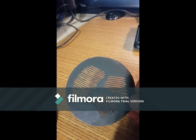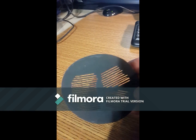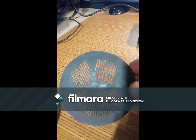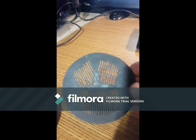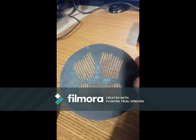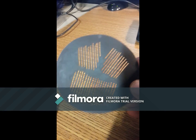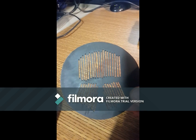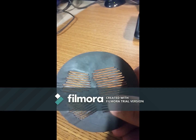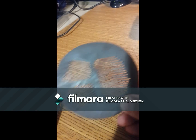Here's the final result — it's a little crude but it actually works. I took it out last night. The Dremel worked really well; I think if I'd been a little more careful, those lines would have been better. I'd worked all night the night before and only got about two hours of sleep, so I was probably too tired to be doing meticulous work. But it works, and that's all that matters. When cutting these lines with the Dremel, start in the middle and work your way out — you can't really start on the end and work across.